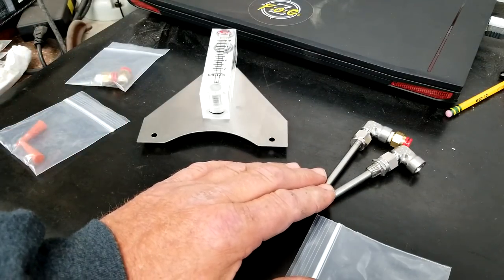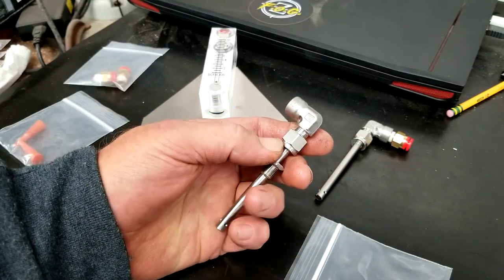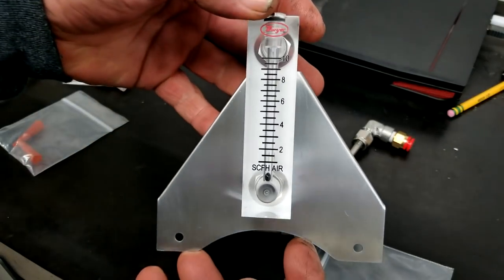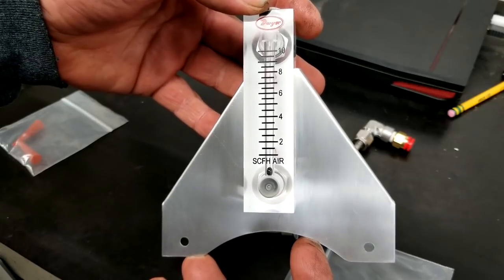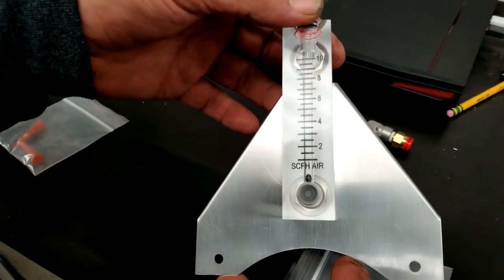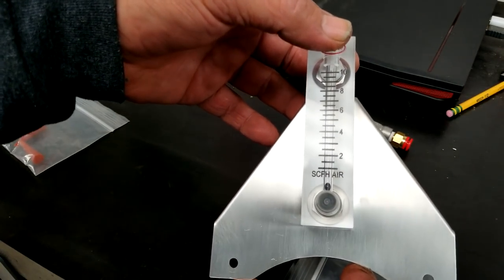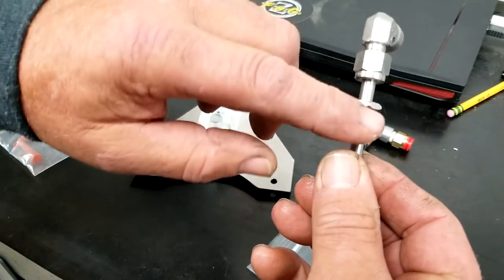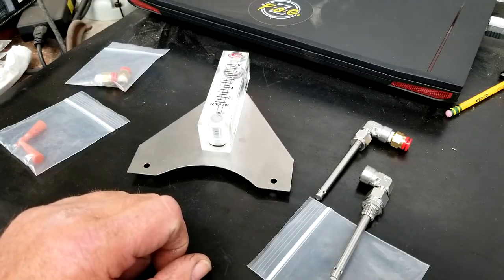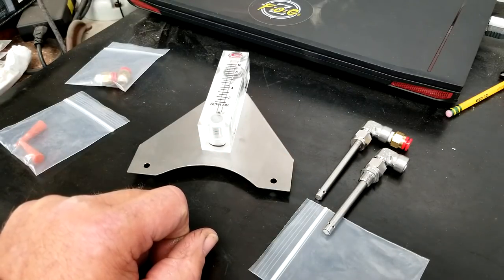What I want to do today is a full temperature test. I'll install the new bushing so I don't have a permanently installed injector, and I'm going to run the oven all the way up to 2000 degrees. We'll flow about eight cubic feet an hour initially to make sure the oven will still make 2000 degrees with 2000 watts despite the extra cooling load from the cold argon. Then I'll check temperatures on this injector to see how hot it's running, and we'll slow the argon flow down to see if that temperature rises. This is injection system 2.0.